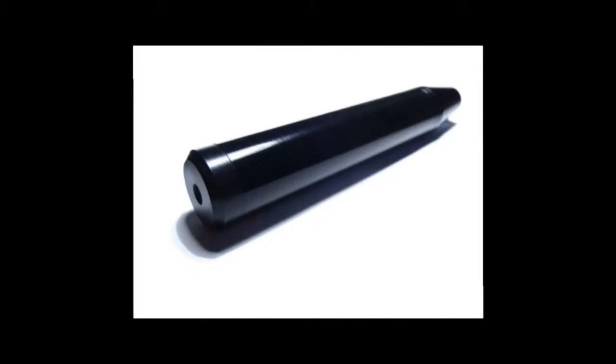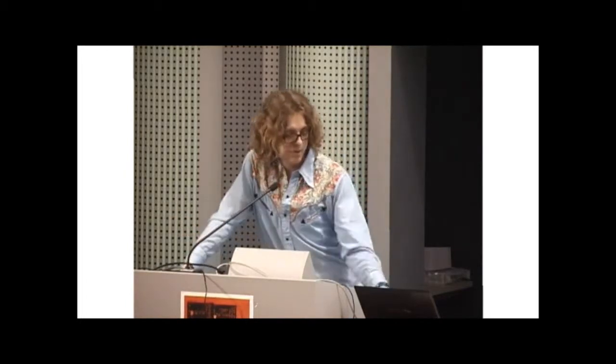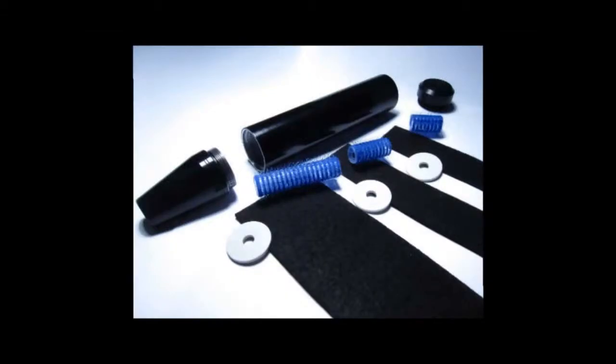Here's another lathe-related project: a gun silencer made for a friend who hunts rabbits with an air rifle — he wanted a nice black sleek finish, best achieved with anodizing. Not only can lathes make tapers and cylinders, they can also make threads. You can see there are some threads here and three components that all screw together, all made on the same machine. The lathe can advance the carriage in synchronization with the rotation of the workpiece, and a gearbox on the end lets you adjust the ratio to adjust the spacing of threads — very versatile.